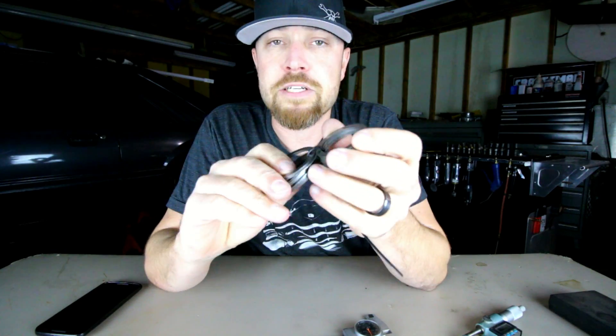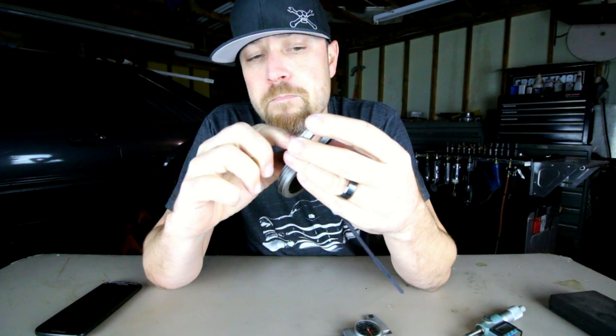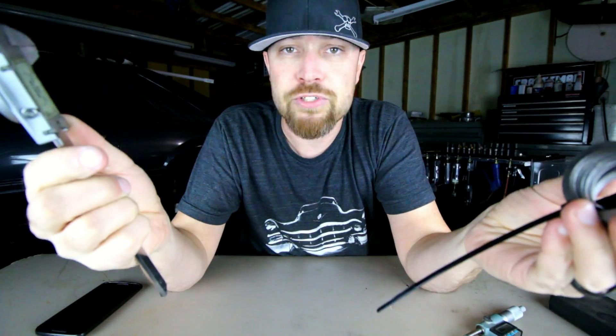Most people probably don't have a set, but I'll tell you they're very useful. I use mine a lot just to measure shims. If you're setting up a rear end or setting up anything that requires some kind of shimming, a lot of times the shims either don't have the thickness written on them because it's either worn off or it was never printed to begin with. So a good set of these — you can measure your shims and make sure you have what you need. Precise measurement, the all-time need for some kind of precise measurement on something — these will do it for you. I know these aren't your normal fabrication tools, but you do need a set.